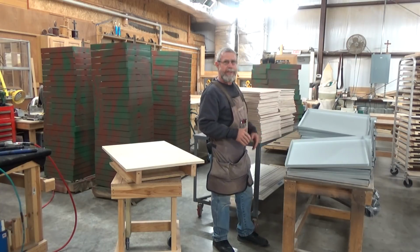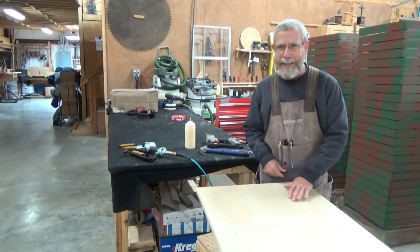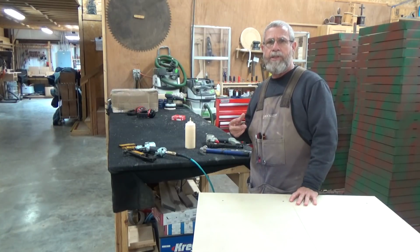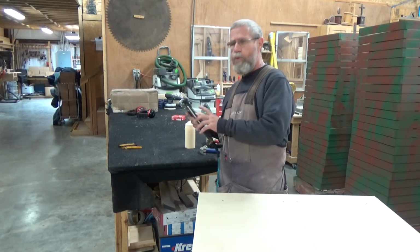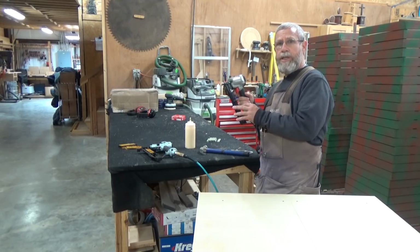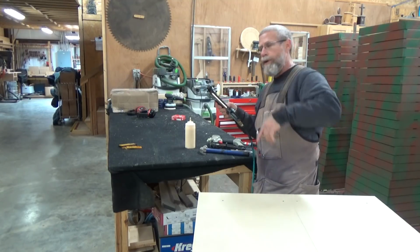And I think that we may as well just go ahead and build one. Let me show you what I'm using to assemble these things. Well, again, the first thing I'm going to be using is my nice little Lazy Susan platform. This just is a great, great tool right here. And how I'm going to be doing these assemblies is I'm shooting staples. That's all I'm shooting is two staples, two different sizes. In this gun right here, I've got 1¼ inch staples. They're 1/4 inch by 1¼ inch. And in this gun right here, I'm shooting a 5/8 by 1/4 inch staple. So this gun, I'll be shooting the metal, attaching the metal to the covers. And this gun right here will be shooting the piece of plywood to the frame part of our cover also.